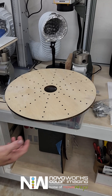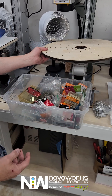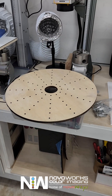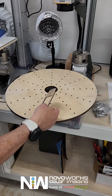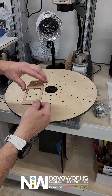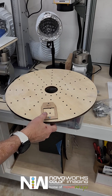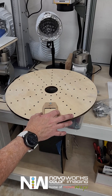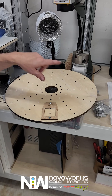This is one of my new rotary jigs designed to fit both on the fiber and the CO2 galvo, so you can basically cut custom jigs. This one's set up for these to lay in — I've got it at 1.8 by 2 inches. You just drop it in, and to keep it simple you could not even bolt it in; it moves a hair but it's not a big deal, or you can go ahead and bolt it in.